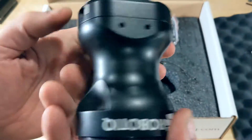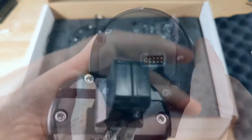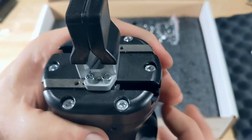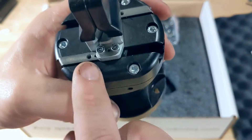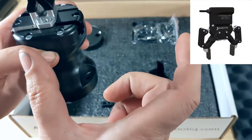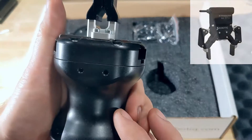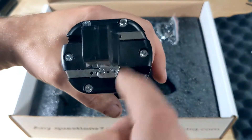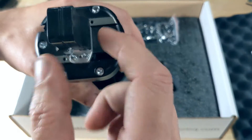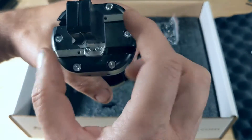It's got a lot of heft, it's really nicely done. It has these grippers on it — they're like a soft rubber. Now there are two types of end effectors typically: one uses leverage to pull two together, but this style here, each finger is on a track, and probably inside here is a gear, so it works kind of like a rack and pinion — as that gear turns, these move out or together.